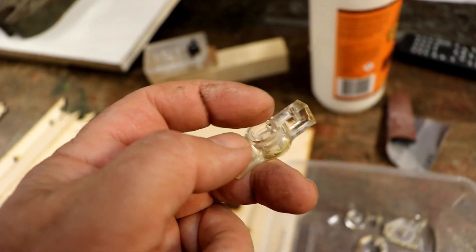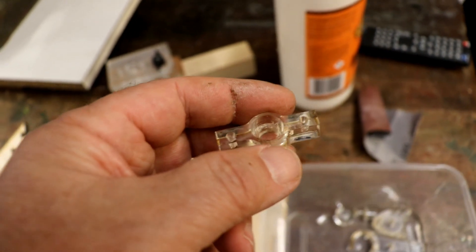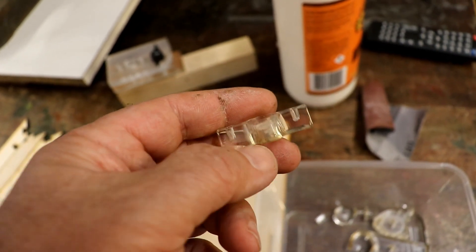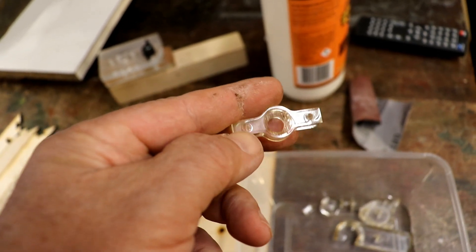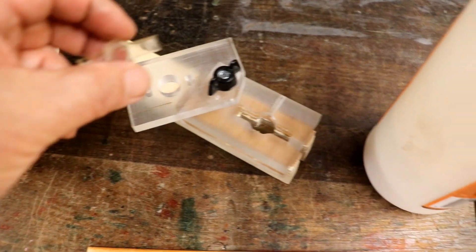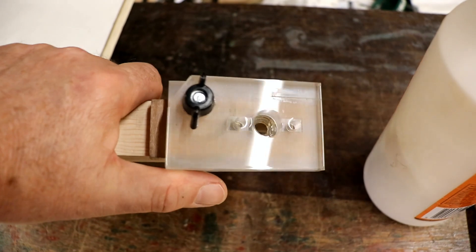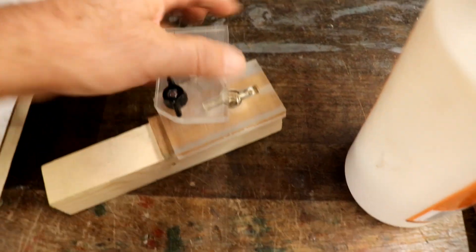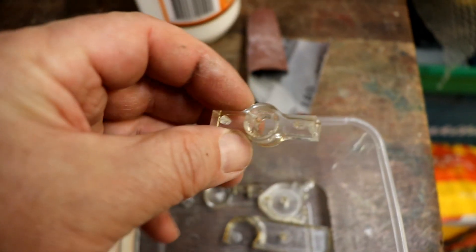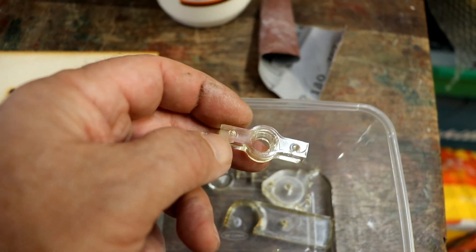But it was taking ages, and I subsequently had to drill them all out again with a proper drill bit because it just wasn't accurate or predictable enough - slight differences in the structure of the acrylic meant sometimes the rods pushed in, sometimes they wouldn't. So I built a lovely jig into which these bits drop. Clamp it down - that gives you something large to hold while you drill out the bits. 12mm in the middle and 3.3 at the sides. This time I've just got the laser to engrave 2mm pilot holes down exactly where I'm going to use the proper size drill bit.